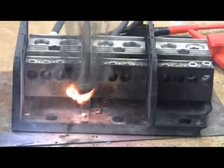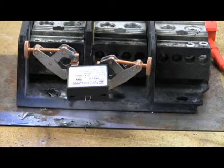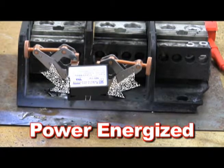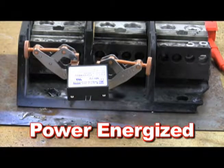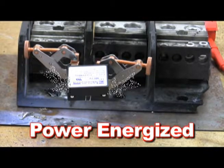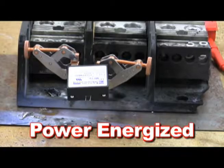Let's take a look at how a thermally protected MOV behaves when subjected to the very same conditions which caused fire, smoke, and eventual failure of the standard metal oxide varistors. This 480 volt thermally protected MOV unit is being subjected to a 700 volt sustained over-voltage. As you can see, the thermally protected MOV emits no smoke because it's disconnected long before the MOV can go into thermal runaway. Operation of the thermal protection is evident through the activation of the thermally protected MOV's flags or ears protruding from the housing.